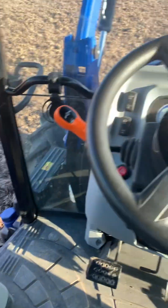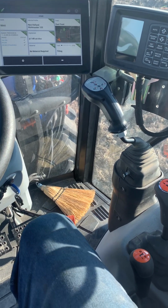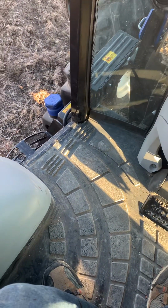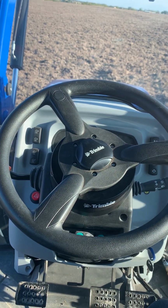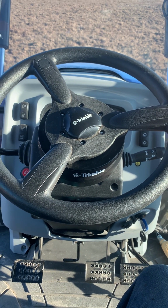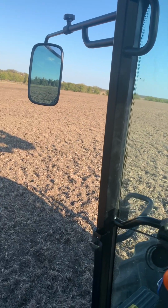There's a hydraulic pump noise in this thing too. I can't pin it down, like it's sucking air, and the pump is vibrating against metal. It's the best I could explain it. It feels like it's right here under the tractor. It's just weird. If you were to buy one of these things, just run it up to 1,800 RPMs or something, and go through this cycle on the loader and see what it does, because I noticed it after I bought it. So, seat chime.